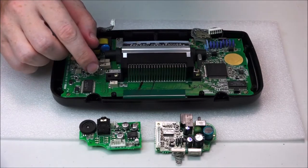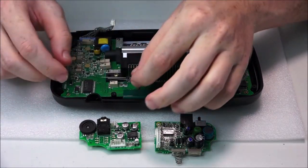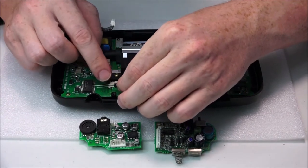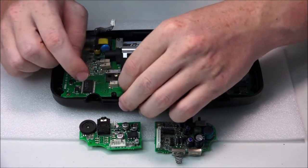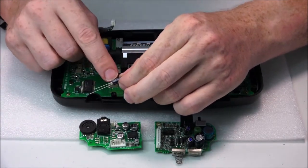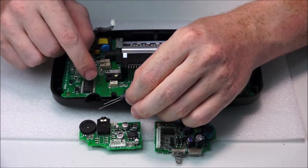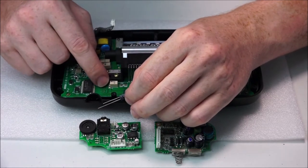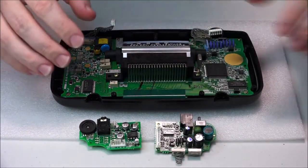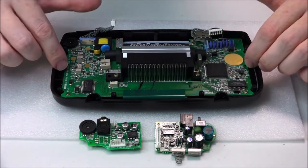And then you can just get in there with your nice new capacitor. So let's get an example one here. You just get in there, so you cut the legs, bend the legs a little bit, put a bit of solder on there, and then of course from point to point. Now remember, don't get the negative and the positive mixed up, but on the board, nicely enough, there is usually a positive and a negative, and I'll try and zoom into that a little bit later. But before we get to that, we just need to assess the board, see how good or bad it is.